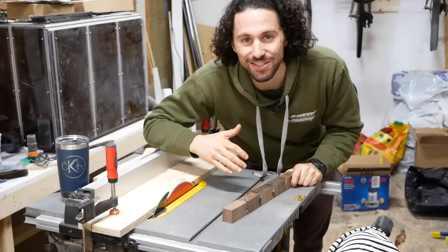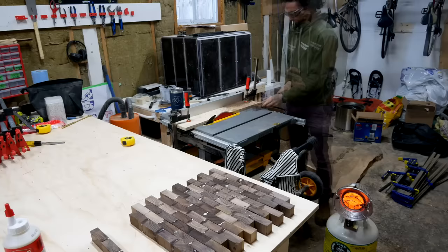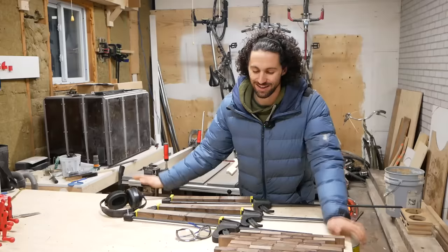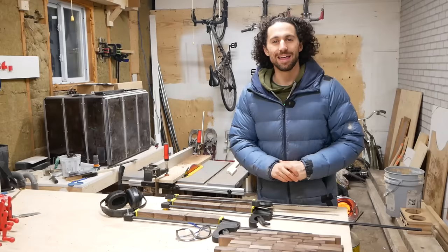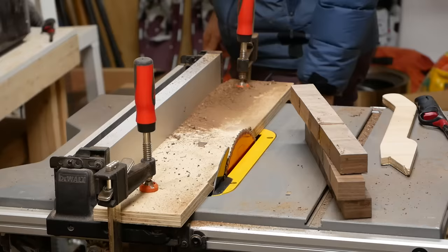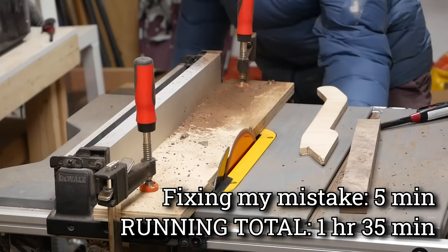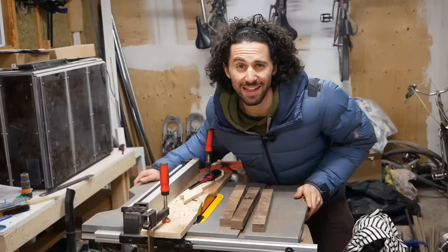So I'm going to use my jointing jig to flatten these faces on the table saw — it's super easy to set up, I'll link the tutorial in the description. I clearly didn't let the glue cure long enough, because three of these stacks broke along the glue joint as I was pushing them through the jointing jig. It probably doesn't help that it's not very warm in here. I glued them back together and brought them into the warm house for a full two and a half hours. I dropped one, but luckily the glue joint survived. Let that be a lesson — don't rush, it's never worth it.